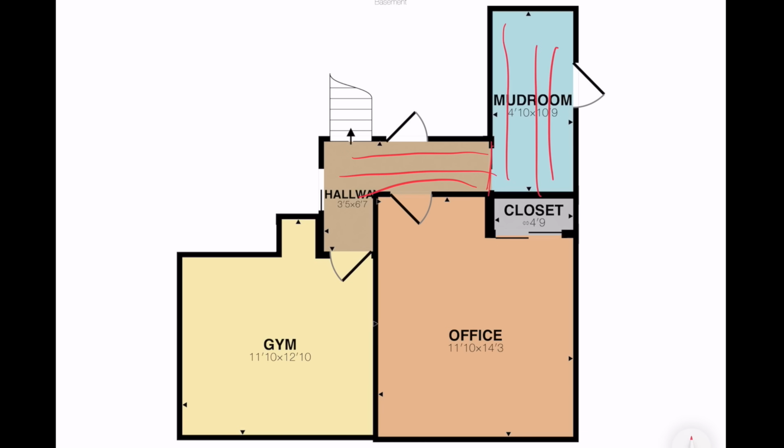And furthermore, if you're using vinyl plank flooring, because of that locking tongue and groove mechanism where the end of the board has to go into another board and lock, you can't actually do that without putting a transition piece there. And having transition pieces in between the rooms, it's raised up, so you're going to stub your toe. It's just an obstacle that's in the way if you are trying to push something across the floor or mop it. It's a place for dirt and dust to collect, and I just don't think it looks aesthetically pleasing.